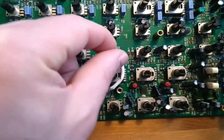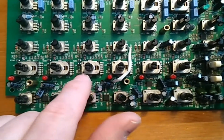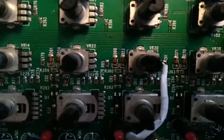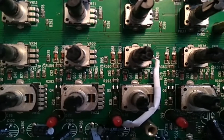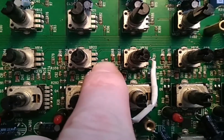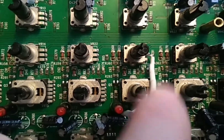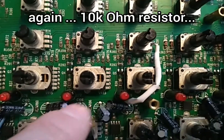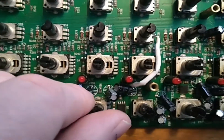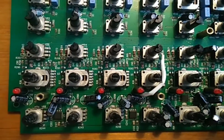Right now this potentiometer is pre-level, as a pre-fader. Like I said, you can do it with every channel. Over here you've got resistor R85, this little one, which goes directly to the middle pin. If you pull it out and solder another 10k resistor over to the plus side of this capacitor, you can modify this pot to work as a pre-fader pot also.